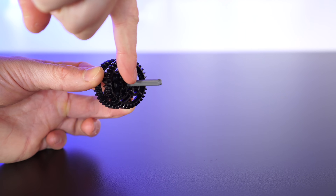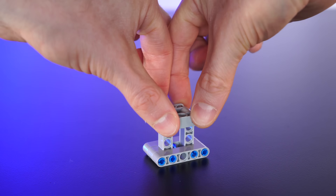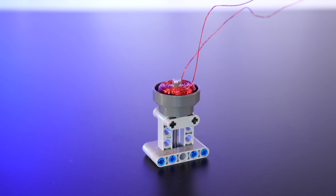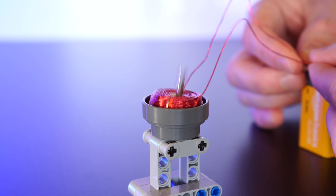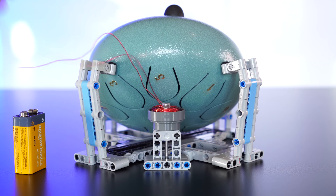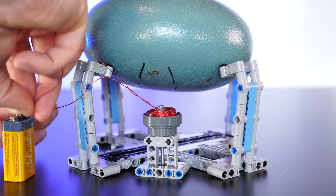For our solenoids, we can simply pop a couple of gears onto an axle, secure one end of the wire, and then just wind a couple of hundred turns of copper wire onto it, leaving us with this lovely tight solenoid coil. To make sure our idea for the solenoid actually works, let's give it a quick test by popping the coil into this little jobby. Then if we take an iron nail and give it a little rubber head, we can drop the nail into it, and with a 9 volt battery when we connect it, the nail jumps up into the coil. This looks perfectly powerful and responds nice and quick. Even at this stage this sounds perfectly good - the notes sound relatively clean and the solenoid responds immediately with a lovely ringing.